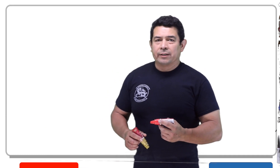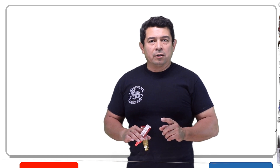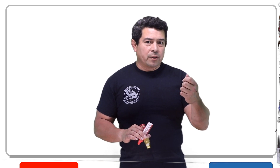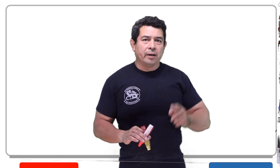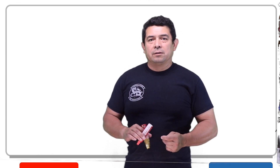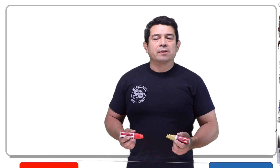The trick is that once you get everything set up, don't forget to purge your hoses. You've got to get that air out of the system, so you're going to crack the hoses a little bit and you're going to hear that 'pssst.' You want to do that very gently and really quick because that gets all of the air out of there. If not, you're going to send that air and moisture that's in the hoses into the system and contaminate it. So we purge the hoses — 'pssst, pssst' — and that's what they call a de minimis amount.